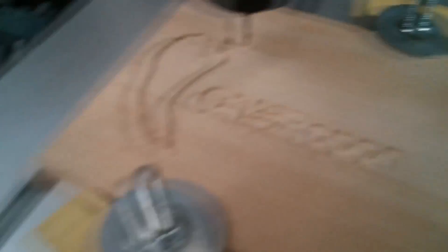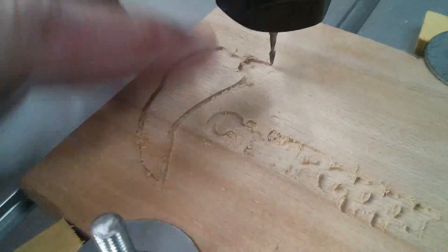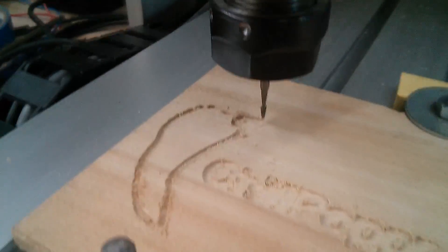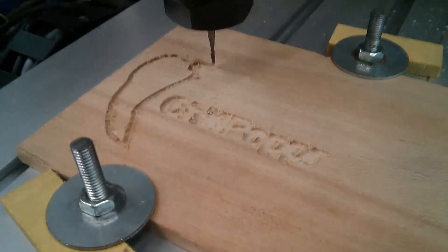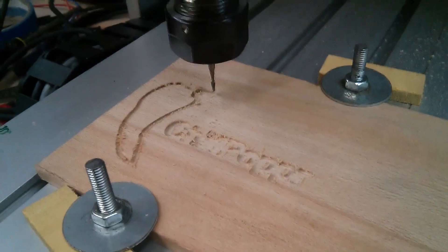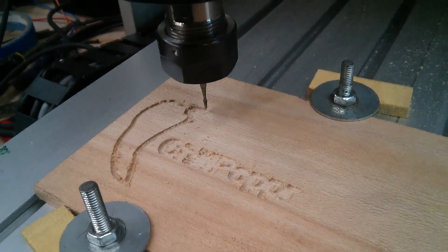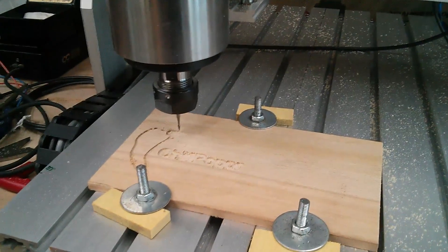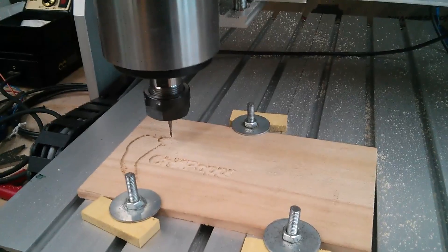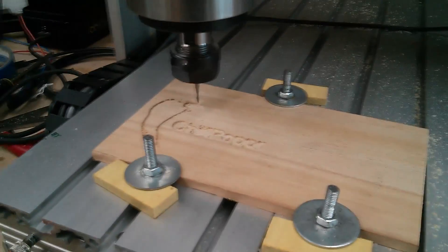I would say that was a success. Our speeds and feeds aren't right — I'm not even sure what this bit is made for. But it totally worked. It didn't seem to have any problem moving the motor around. I'm still going to have to get some faster G-code in here to really crank this thing around and see if it can keep up. Unfortunately, with the limit of 30 volts on the TinyG, I can only run them at — I want to say it's 12 revolutions per second. I don't remember the math for the ball screws, but it's only something like an inch and a half to two inches per second maximum speed for these.